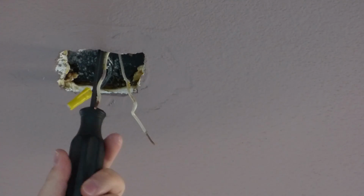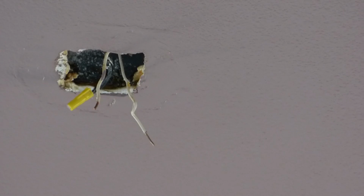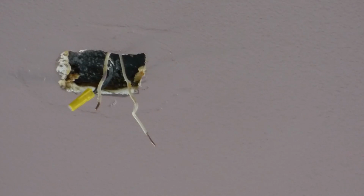Yes, it's tied off to the top that I think I'll bring down. Even though this is grounded through the, technically, if I screw this to the top there, this is going to be grounded through to the box. The box is metal, and the screws are metal. And they're all happy. Let me fish that electric down. Alright, check out that ground, moved it a little bit. So it's actually attached to the box and there's a little bit coming out that I can attach the wire to. Now then we're back to this here.